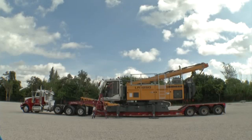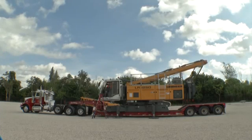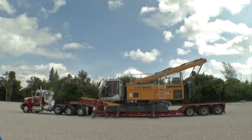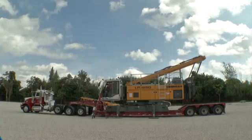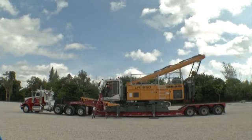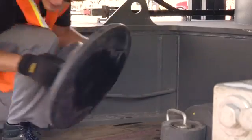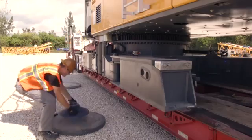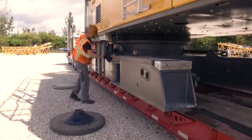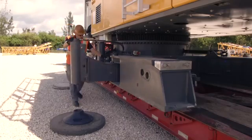Before the main boom A-frame, sometimes also called main boom mast, can be moved into position, the basic machine must be supported via its jack-up cylinders for safety reasons. Make sure that the ground conditions are sufficient, firm, and level. The outrigger pads for the jack-up cylinders are placed in the useful storage trays on the undercarriage during transportation and operation. Fold out the cylinders from their parking position.